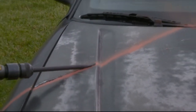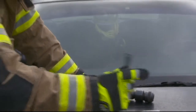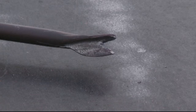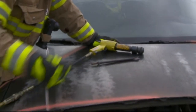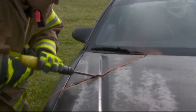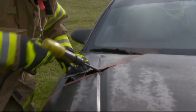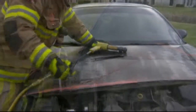You've got to make sure that you don't force these, misapply them, or have too much pressure behind them on a structural application because it will shear off the cutting segment. The chisel bit is designed to cut all the way through. These require a little more technique to ensure that you don't just drive this blade all the way through the cut, which can then cause it to get lodged or displaced from the air chisel.